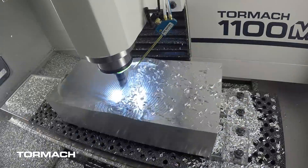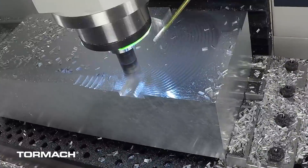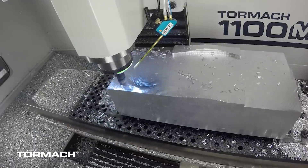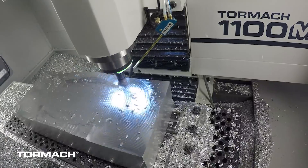We did have a fine step-down on this part. We had that 0.300" step-down cut, but our fine step-down was set at 50 thousandths of an inch. That gives us the nice smaller scallops so we can come back and do the semi-finishing a little bit more easily.